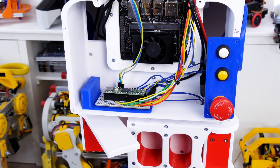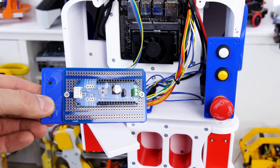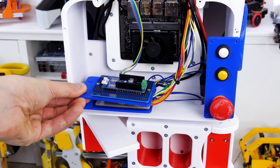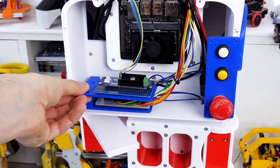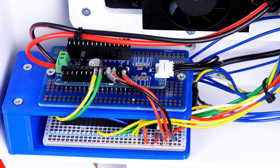Now it's time to power up those Dynamixels. I've got the Dynamixel MKR shield here, which is mounted on another 3D print that fits neatly above the Teensy so I can just cable that in with some jumper wires. Thanks to Cool Components for sponsoring lots of the electronic components in this project, including the perma-proto board, which is a solder version of breadboard so you can move your breadboard layouts over really easily. I use right-angle pin strip to attach the wires to the shield so they come off really easily and I can remove it to get to the Teensy.